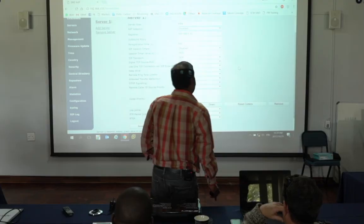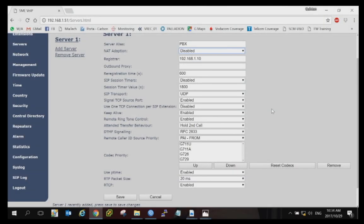Okay, sorry, outbound proxy. We said PABX IP, am I correct? Yeah. Okay. So let's put the PABX IP in. Outbound proxy, PABX IP. Okay. Do we need to change any of these items here, guys? Anything else on that page?